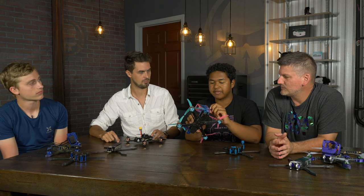But also, I saw you have your talking point about the way the carbon fiber was weaved together and the strength comes from the weave. I thought that was a really intelligent way to look at it. I never thought about it that way. Absolutely, because it's not a solid material. You look at aluminum, it is uniformly strong in any direction and cross-sectional area plays a big role. But if you look at a composite, and carbon fiber specifically, it's strong in one direction more than the other, which is why it's really important when you make arms that you have the weave oriented the correct way.